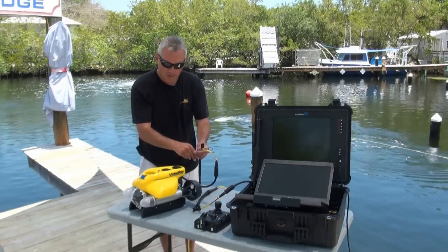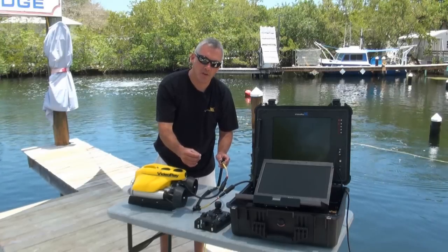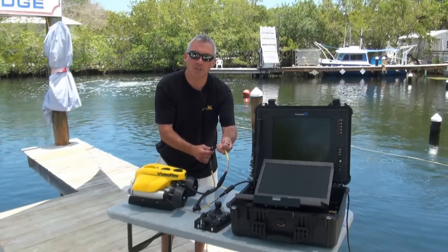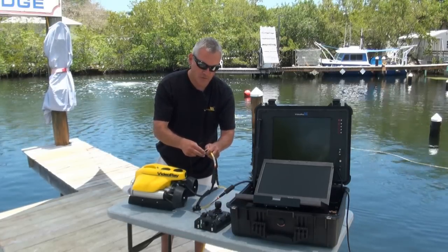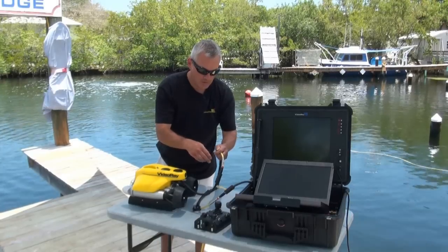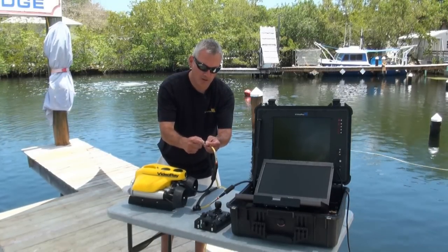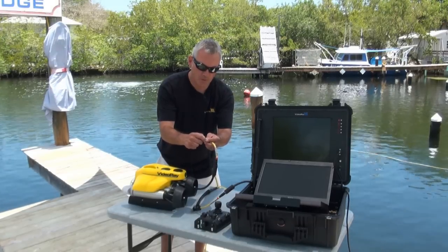The one thing we need to point out on the back of the ROV is this thin metal wire that's sticking out — we call this a strain relief. Paired with the nylon sleeve at the end of the tether and a carabiner, we're going to transfer any weight away from the tether connection to this metal strain relief and nylon sleeve. We'll unscrew the carabiner and lock it back up after we insert the loop of the metal strain relief.